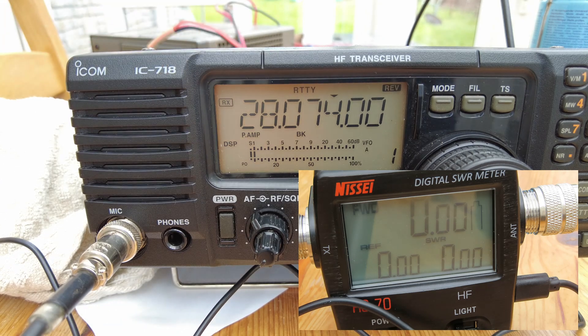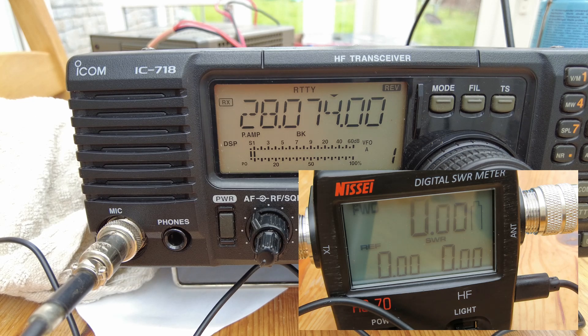So you've got no problems with the power output or the PA in this radio. It does have a very noisy receiver though - I don't think I'll put it back in the second shack, I'll leave the ICOM 7000 there. What I do with this radio - I may sell it on, or I may use it as a data mode dedicated radio, not too sure yet. That was the ICOM 718, quite an old radio now. I didn't pay an awful lot of money for it but I've been very disappointed with the receive performance. You may see why I had my doubts about the power output - when we look at the power output meter here, it's showing just over 50 percent, but I'm getting in the region of 90 watts. So yeah, it's a bit of a strange one. Thank you for watching.